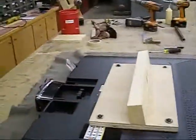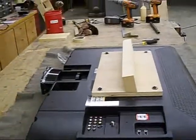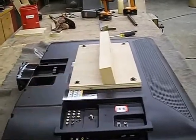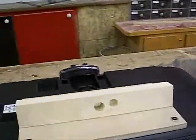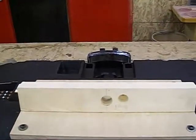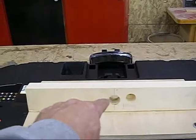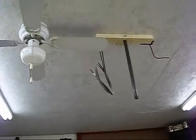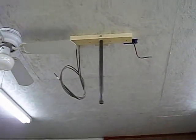So I took that 10 degree angle and made a base plate right there, drilled the holes on center for the mounting holes in the TV, and then that block there is the 10 degree angle cut. It's got a through hole — don't pay attention to the one on the right, that's for spiders. This through hole is for this bracket I have up here in the ceiling. It's a piece of three quarter inch pipe with another wooden bracket glued and screwed to the truss up above.